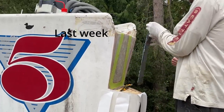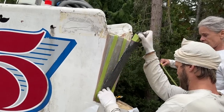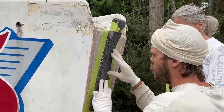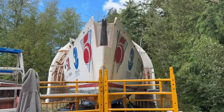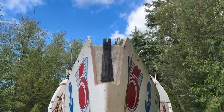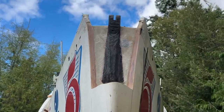Last week I just glued the Code Zero chain plate to the stem. We had a few concerned commenters worried that it won't be strong enough. The reason that I can do that is the chain plate itself has a lot of gluing surface area, and we can show mathematically that given a certain amount of surface area, the epoxy is strong enough in shear to hold it. And I'm gluing it to a part of the boat that is already structurally sound.